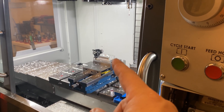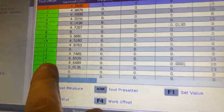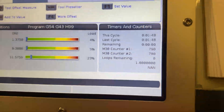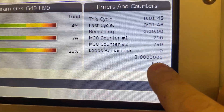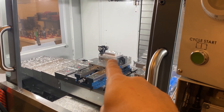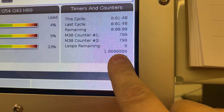When we go into the offsets tab, we can see that for Tool 15 — that's what we're using — it corrected it one ten-thousandth. All that would be left to do, and it doesn't matter much because this little VM2 is actually quite accurate, is to make sure that what's in the offset is exactly what this says it is.